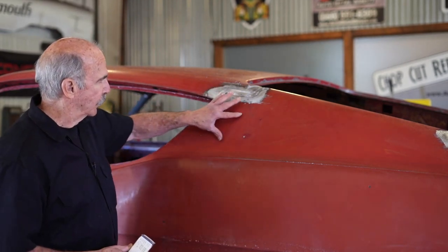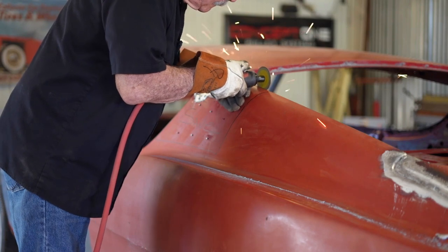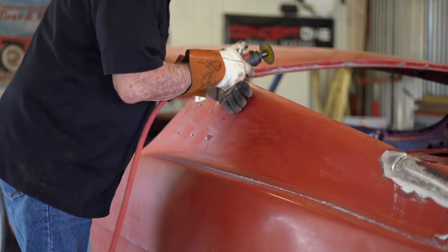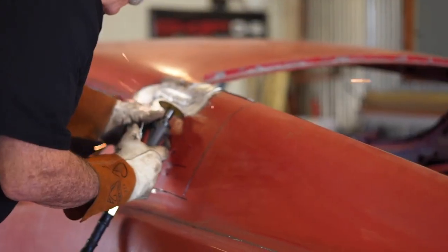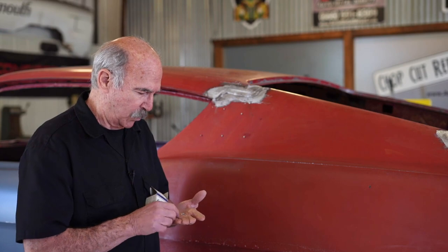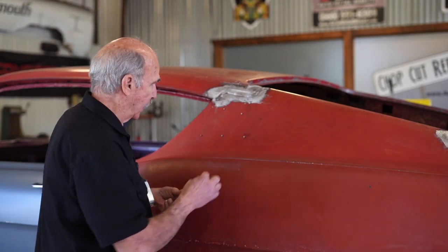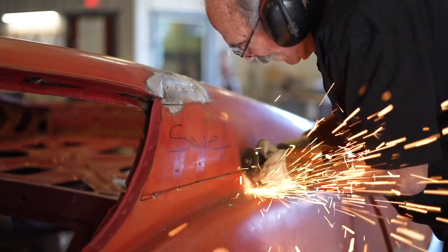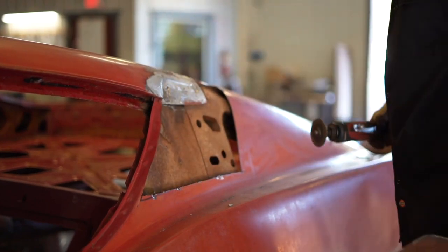These projects are all about the tips — make your life easy. Ford has some little stylized pieces here kind of duplicating scoops, and they have the pins welded to the car, which I could duplicate, but it's very problematic when you're color sanding the car. So there's a cure for that: there are trim screws with little heads on them. I'll give you a better shot — they can go in here, but we'll cut this piece of panel out, save it for a pattern on both sides.